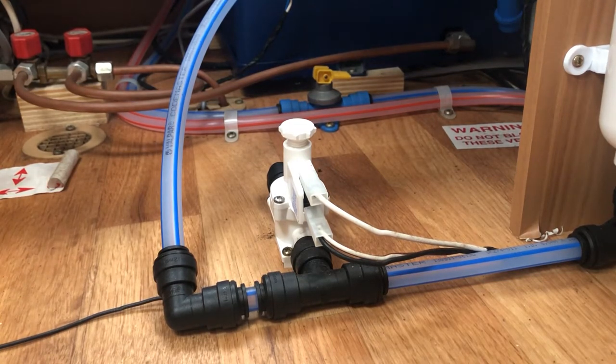The correct place to adjust this water pressure switch is the shower on cold. You need to run it through the shower head on cold — it's the furthest distance usually away from the pressure switch, and it's the place where you need constant pressure. I'll now demonstrate how to adjust it.